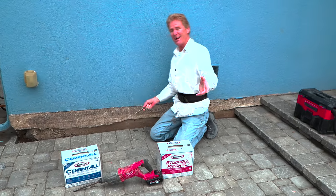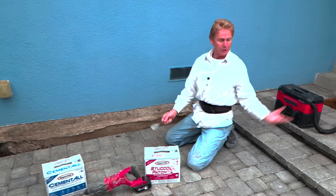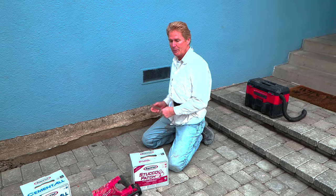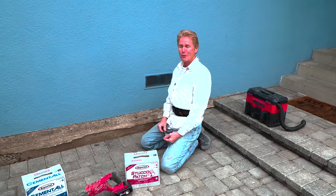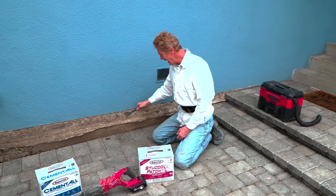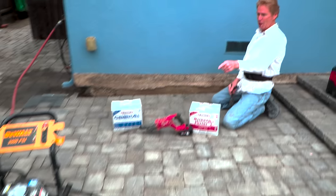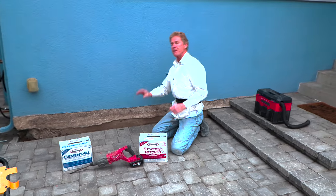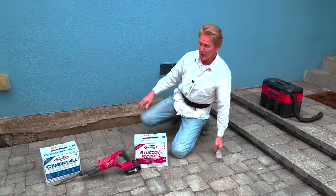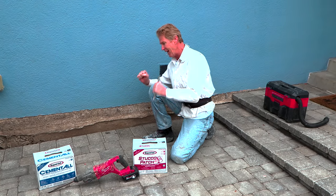Just yesterday Jay and I were driving home from a job and I stopped and looked at this. I told the guy I'd just use some elbow grease because I didn't want to bring my big compressor. Jay says, 'I heard you say elbow grease — what I heard was Jason's going to use elbow grease and it'll take him about a half hour to scrape this down.' I said it'd take me five minutes to put that pressure washer on. That pressure washer is 3,400 PSI and with this turbo tip it gets up to about 4,000 PSI. When we hit this it'll get all the dirt, take the paint off — it'll take the rubber off a boot if you hold it down — but it'll micro-etch the surface so that when we put a bonding agent on here, it'll set and our material will last.